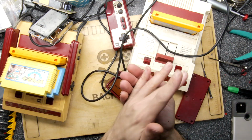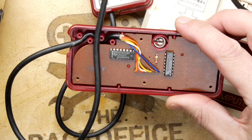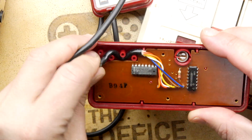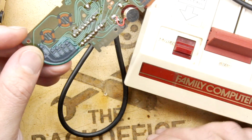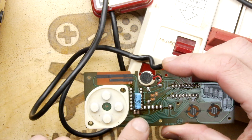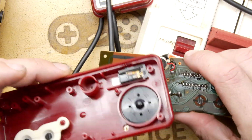So yeah, it looks like there is a little condenser microphone in there. Interestingly, let's see what we can see. Let's zoom in. Bang. I'm not seeing a capacitor, not on this side at least anyway, but let's just undo this a bit more. Oh, there is an electrolytic capacitor. So the two things that are most likely to cause issues in this circuit, of course, are that capacitor and this slide contact. And that slide contact marries up with that, and it's basically a variable resistor.